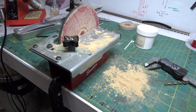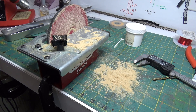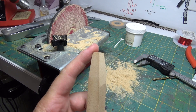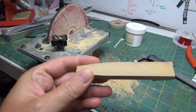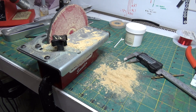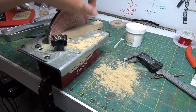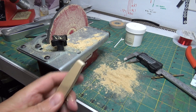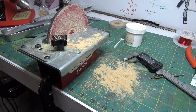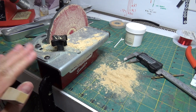So let's go take a look at that Ultimation Sander. I apologize for the mess here on the work desk, but hey, this is how you know I've actually put the thing to use. That concrete base for the signal we were looking at — this is the aftermath of making one of those. In hindsight I probably could have cut the wood down smaller first, but that's how you learn. So here's what I used — MDF. The first one I did, I learned you should use a bigger piece so you have something to hold on to. I sanded it down, got the top to the perfect dimensions using calipers and measuring the bottom of the signal bases. Then it was just a matter of sanding it down, and when it was to the perfect dimensions I just cut the top off with my chop saw. It's really cool that you can do really complicated shapes like this quickly and precisely using this Ultimation Sander from Fast Tracks.